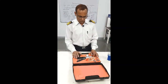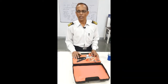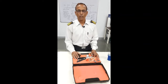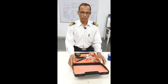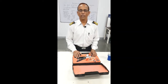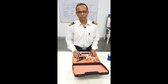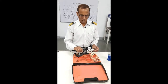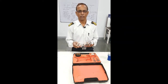These gauges are to be checked and sent to shore for calibration. The Pressure Gauge Calibrator and Temperature Calibrator are to be sent ashore for calibration every year. You get a certificate confirming they have been calibrated, and then this becomes the Master Gauge for you.